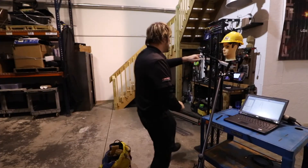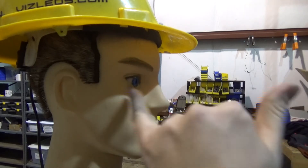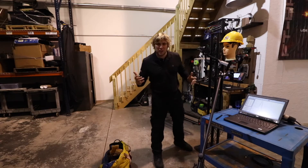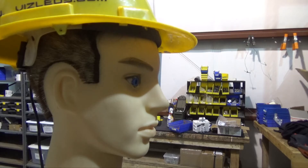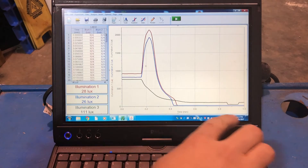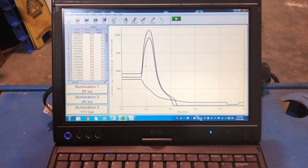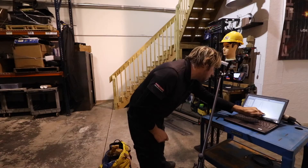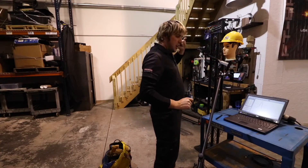Check this out — you can see where the shadow is now cast. His eyes are completely in shadow based on the short brim of the hat. Imagine that's the front edge of a fire helmet — it's the same deal. When you elevate the light fixture, you use that hat brim to your advantage and keep light out of the fireman's eyes. You'll see an even sharper cutoff here — right where the light fixture elevation changed. We're able to get such a sharp cutoff using the brim of a hat that there's almost no light hitting the fireman's eye at all, meanwhile we've got an elevated amount of light on target. That's our goal.